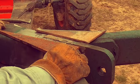All right. Got to put some reinforcement plates on the bottom. So these are odd legs. You'll notice I had that weld that kind of came around the corner. It broke funny, so I don't want these reinforcements to hit where it already had broke before. So one of them is longer than the other one, just to be sure that we're spreading out that load and hopefully not going to have a failure.